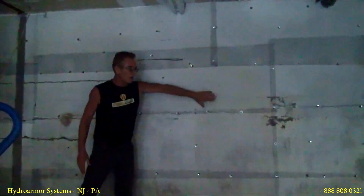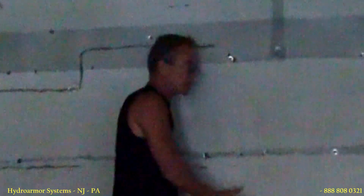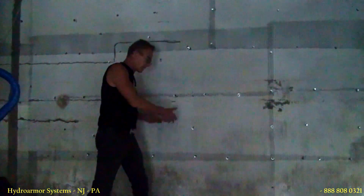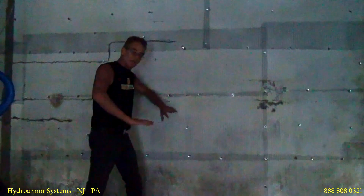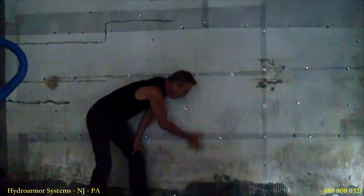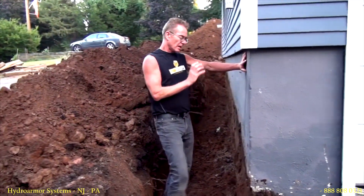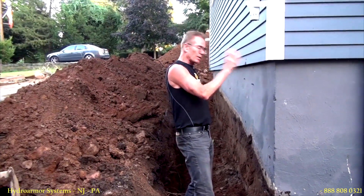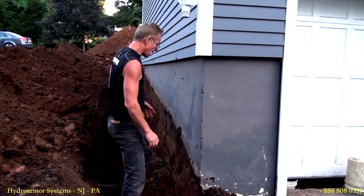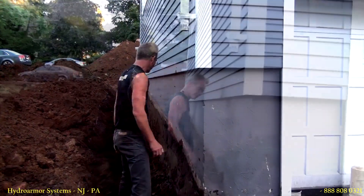This is wire mesh — you put your wire mesh up first, then one coat of cement and then another coat of cement. We have all these rotted blocks down at the bottom. We did not want to shift the wall out because the blocks are so rotted at this point it would have just crumbled. Instead, we're filling the blocks solid and doing rough casting over the front — that will repair the rotted cinder block. On the outside we're putting wall pins in, every two feet, and those get filled with 5,000 psi concrete. There'll be like two beams of solid concrete going all the way down — the wall will never move.